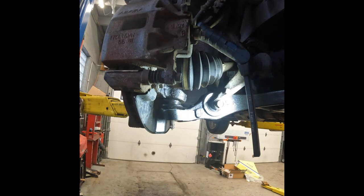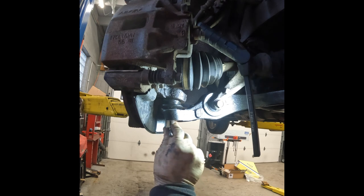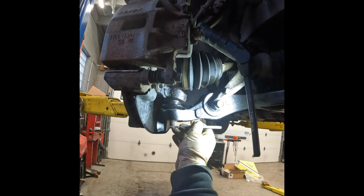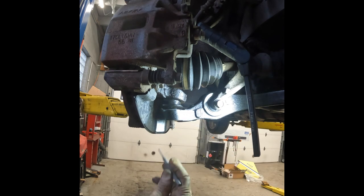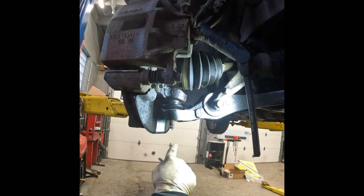There you go — that's all I needed. Usually if they're stubborn and don't want to come out, you can run a drill bit in there. Drill bit size depending on what you're working with can vary. This one gives you a lot of generous room. All I did was take my little punch and just ran it in there. If that doesn't work, you drill it out.